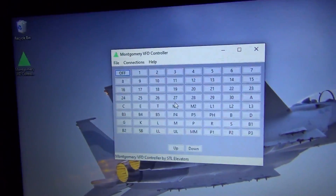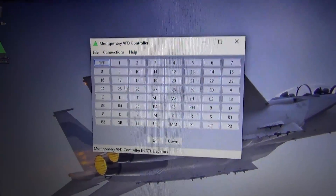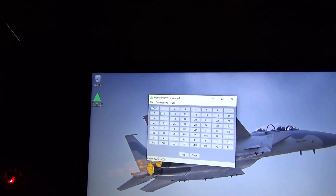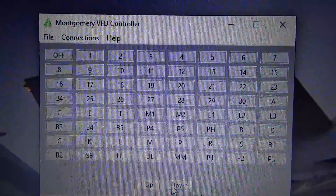For the simulator implementation I obviously don't want to be using a test mode because I have no control over the indicator. One of the big things I did before starting this project was figure out how to interface with the Montgomery VFD, and that resulted in this software I made. This is a little user interface that has every single combination of characters or letters that you want to display on the indicator. There's a pre-installed symbol library on these indicators — these are all the things we can display. I'll go ahead and connect to it, select one, and you can see the one comes on. For the simulator it would be pretty simple — the up arrow would go on and you would just cycle up to the floor that you select, so in this case we'll go up to five.